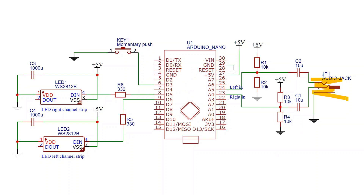The audio comes in through this audio jack just here, and at this point the signal is oscillating around the 0 volt mark — so our sound source is going above 0 volts and below 0 volts. The problem is that the ADC on the Arduino can only go from 0 to 5 volts, so if you plug this straight into an analogue pin we'd actually lose half the signal — we'd lose all of the signal below 0 volts.